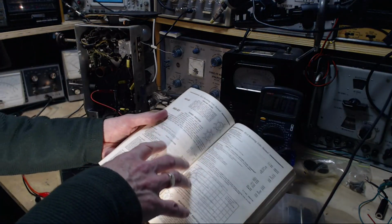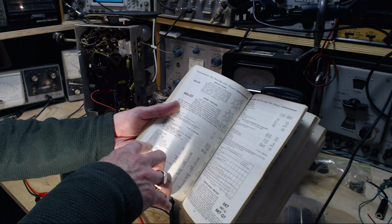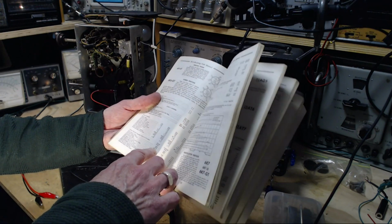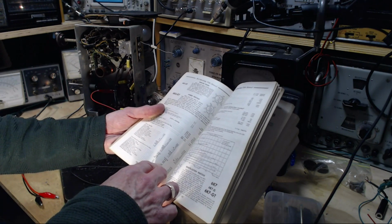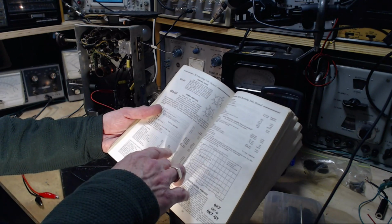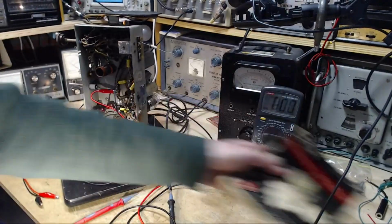Let's just take a look and see what the manual recommends. It should be typical operation. Sometimes they actually give the resistance. Plate, no, it's plate resistance. Load resistance, that's not it either. Okay, not said there. Typical push-pull. Cathode resistor, minus 25 volts in push-pull, 400 ohms. And fixed bias up here, typical operations, minus 18, minus 21, depending upon the plate voltage. Low plate voltage, we'll say 250 plate voltage, that's close to what's in here. What's in here is supposed to be 190, 170. So something less than 18. Hey, that sounds perfect. That all sounds perfect.